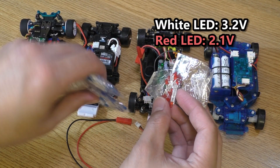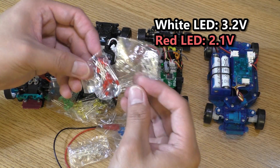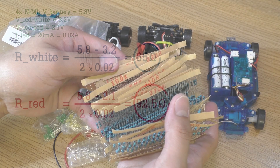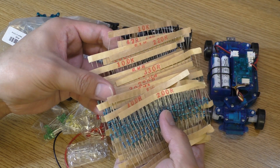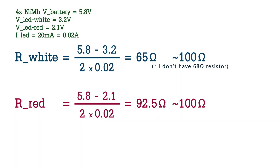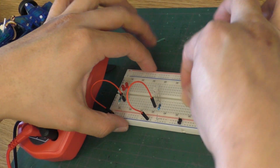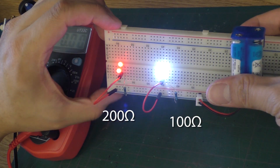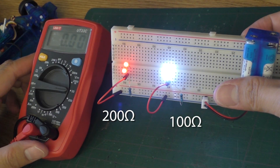White and red lights are running on different voltage so I'll separate them to different resistors. This is the result from the formula I told you earlier. Because the calculation rarely matches existing resistors, you'll have to use the nearest higher rated resistor instead. For me, they are going to be all 100 ohm resistors. I also calculated some more combinations for you in the description — check them out if you use a 2-cell or 1-cell LiPo battery. If you have a breadboard, you should use it to check the circuit and brightness. I ended up using 100 ohms for white light and 200 ohms for red light so the back is a bit less bright than the front. And here's the diagram.